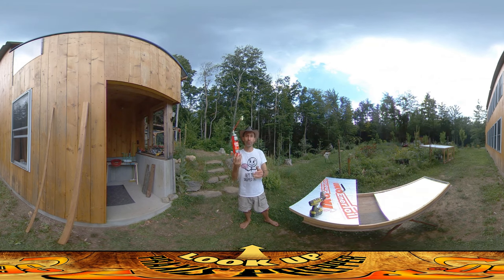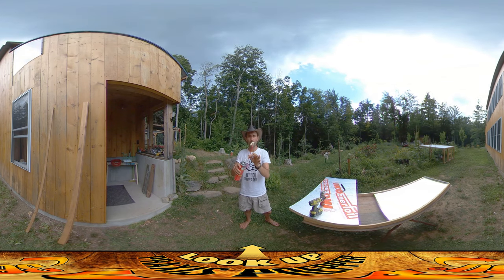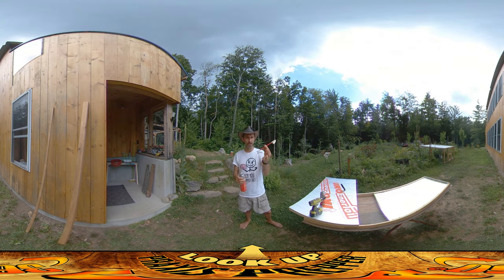What you do if you want to reuse one of these and it's cured all the way down into the can is you take the straw off. The straw is a little bit of a wild card because it is kind of hard to clean, but I find when I use a lot of these spray foam cans, I'll use one and then take the straw from that one and put it on the next open one, and kind of keep using the same straw if I've got a big project. So oftentimes I'll save a lot of these straws — something you should know.